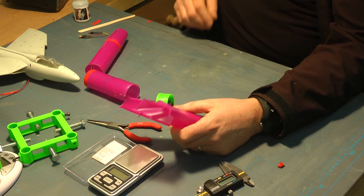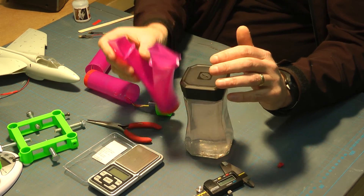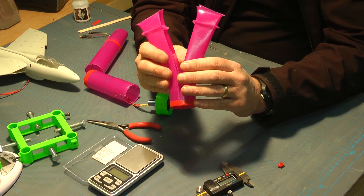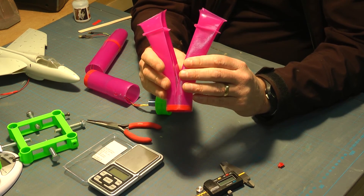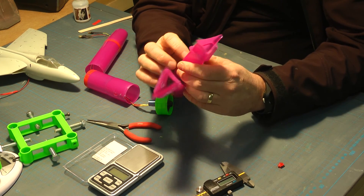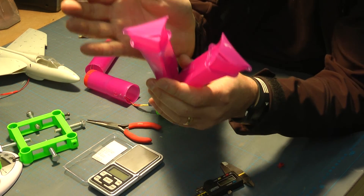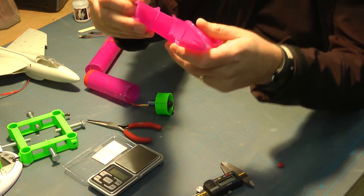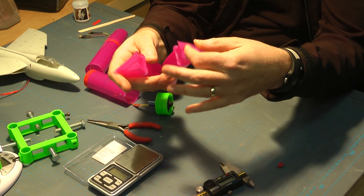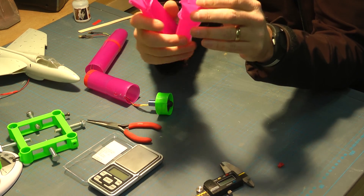What I've been doing instead is literally dunking the part in acetone very quickly — in and out of a jar, literally open and dump it in and out, and that's it. You don't hang onto it. Then get in front of a fan or a heater as soon as you can to evaporate the acetone. I really like the process mainly because you end up chemically welding any loose strands or loose fibers of the plastic. You end up with something very, very strong — it's like solid plastic.